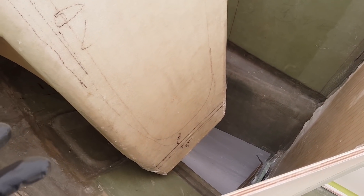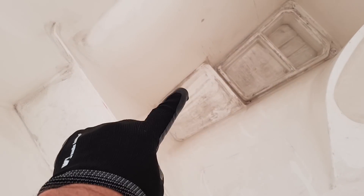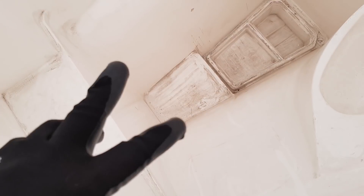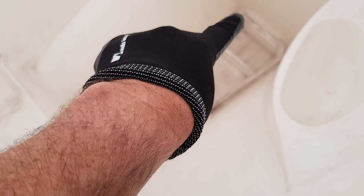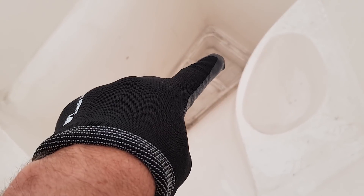When I made this module I knew it was going to be a deep one to get in and out. I've already reinforced all the base with the exception of a piece of plywood for the head to be screwed into. So this module is almost finished — it just needs a little further reinforcement. This is where the head sits and it screws down onto a plywood base. I've got a 12 to 25mm piece of plywood under there the same size as my head so I can screw the toilet into it with lag screws. This section here gets cut out, and this here is the shower sump — probably a 500 to 1,100 gallon-per-hour pump down in there to accept waste from the washing machine, sink, and shower, which will all run down to that sump and be pumped away to the black water or grey water tank.